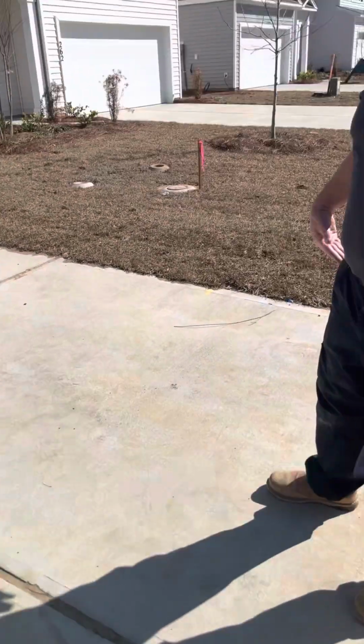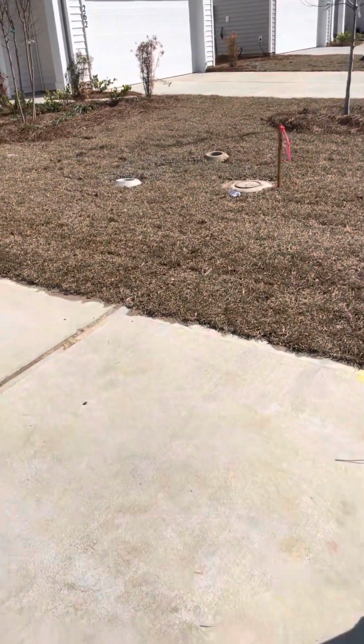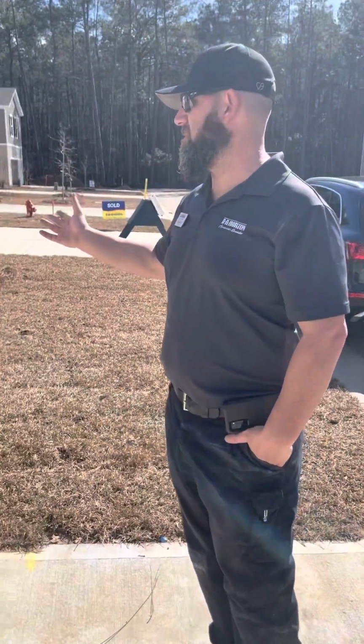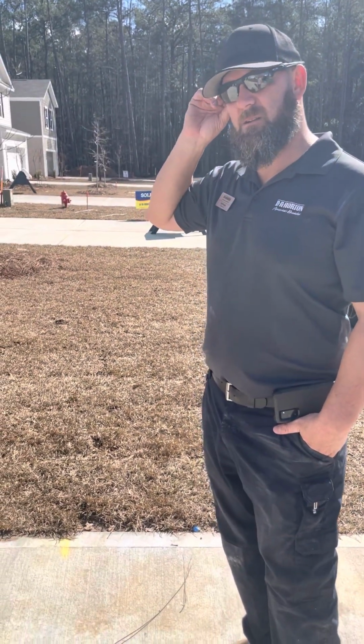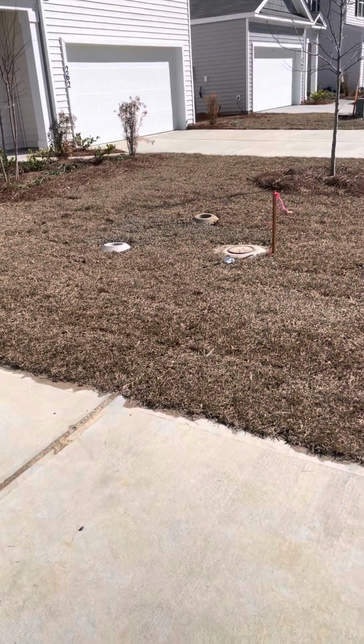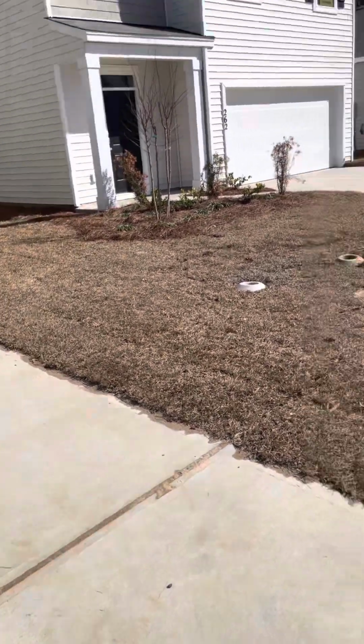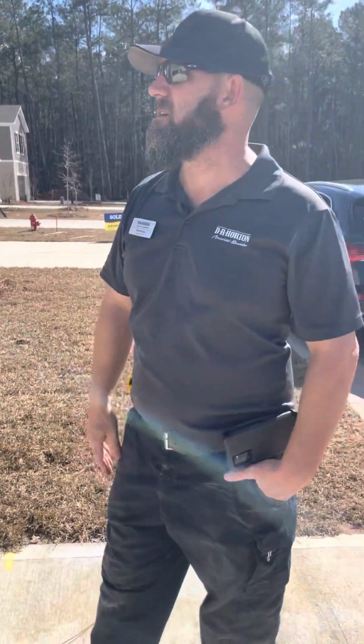All right, go ahead. Got there. Your 4-inch, 6-inch clean out over here. Technically, that's nothing that you'll need to mess with. That's more for your plumbers if you have any back clogs or anything like that. They'll come out here. Your 6-inch is shared with your neighbor over here, so you have two 4-inches. You'll have another 4-inch clean out by the house. We'll see that here in a little bit when we get around to the other side.